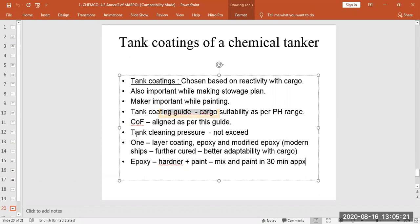Regarding zinc silicate coating — silica is similar to sand, and a modified or treated version is put into some paints. Like anti-fouling paint, the paint layer keeps gradually coming out through leaching. During tank cleaning, there is a certified jet pressure for the tank cleaning machine that takes this paint layer into account. For example, if eight bar is the designated pressure, you should not exceed it much, because excessive pressure can leach out and damage the paint coating.